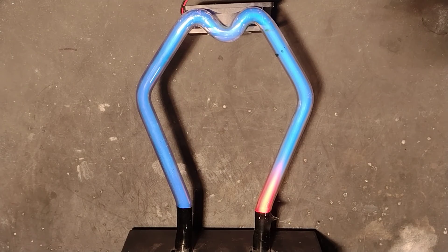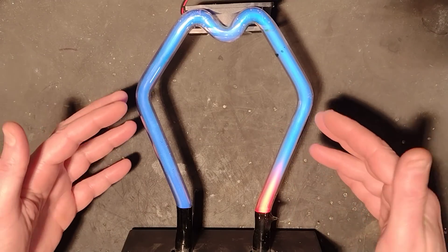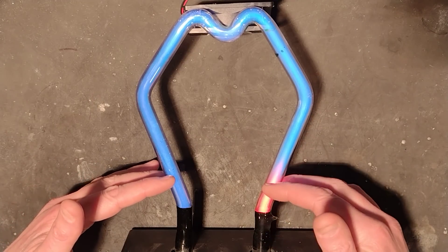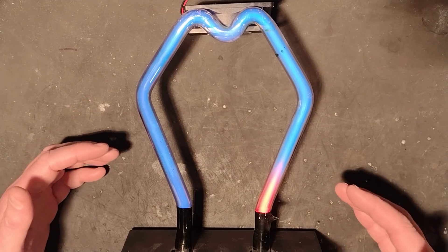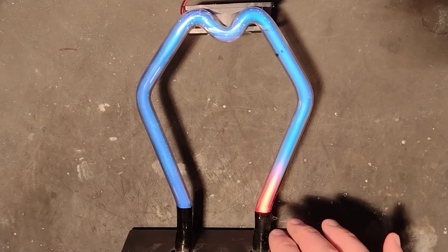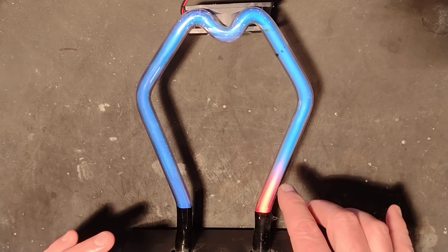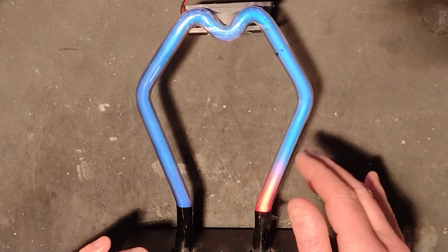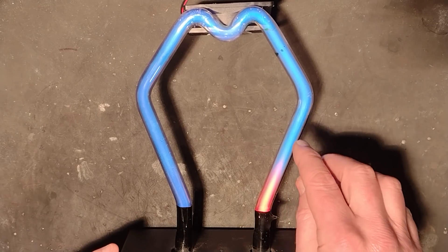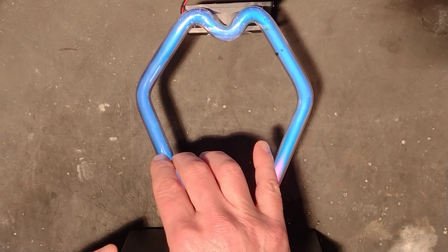This is a very unusual tube. I call it the M-tube, and it's made of clear glass with a fill composed of neon gas but with mercury in it as well. Normally, neon tubes are either purely neon gas — which makes a clear tube light bright red — or neon and mercury, or argon and mercury, or a mixture of both. The mercury vapour is the important bit; it gives off a lot of ultraviolet light and some visible light.